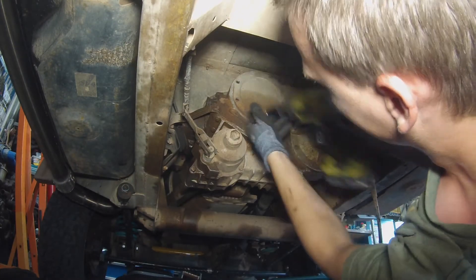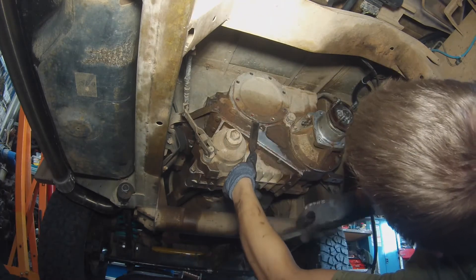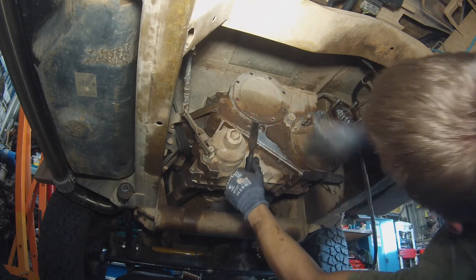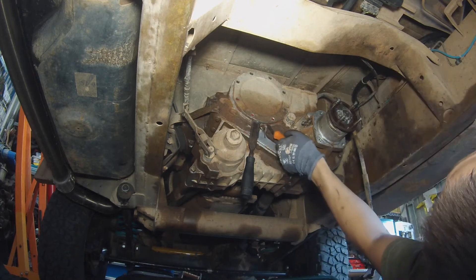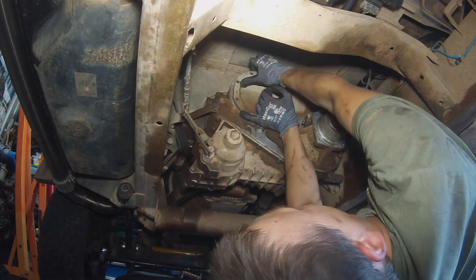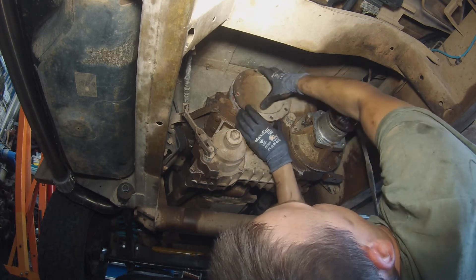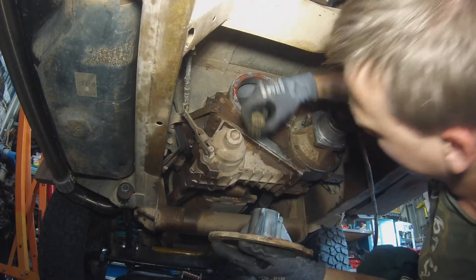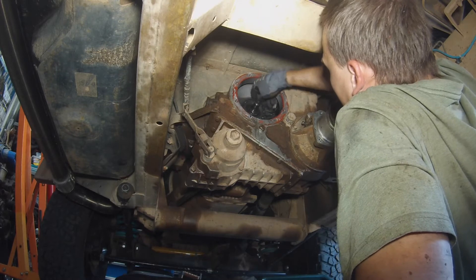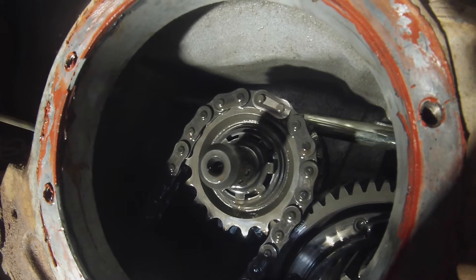At this stage you don't want to wind the bolt out all the way because it's supporting the intermediate gears. Before I can remove the bottom cover I need to undo the chain driving the winch output. Removing the main shaft bearing cover gives me access to the drive sprocket. I like using a screw gun because it speeds disassembly up, but we do have to be careful when working with aluminium threads. The silicon I used to seal the cover last time works almost too well — I had to resort to some rough methods to break the seal. Then it's simply a case of finding the removable link and undoing it, just like any other motorbike chain.